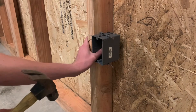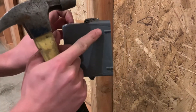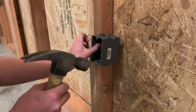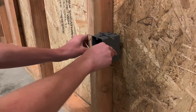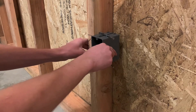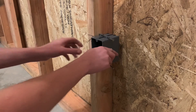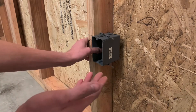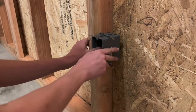So you're going to line up your box on the line — this one is for the top. There are these little marks right here, and these are for half an inch. If you want to do five-eighths, you kind of leave it off a little bit. You just hold it at the half inch right here and push it on there. If you want to do five-eighths, there is actually a little mark on the box, but you can just pull it out a teeny bit. If you need it more, you can always use a tape measure to measure out like an inch or inch and a quarter. But I always like to go half an inch — it's better to put your boxes inside the wall than have a possibility of having them outside the wall. Always do what your employer says; if they want them at five-eighths, put them at five-eighths.